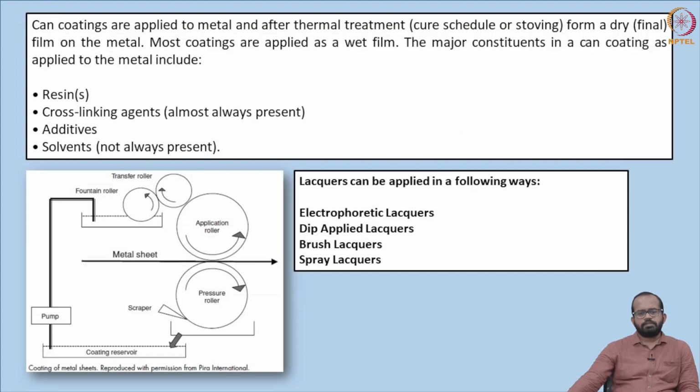So as we discussed, the coatings or lacquerings added are either to protect the metal or the food from interaction between each other, or to protect the metal from the outside elements. So basic food lacquers are made with a resin. Also, the resin will be supported by a drying oil complex, because the oil resin cross-linking can happen and form a uniform layer.